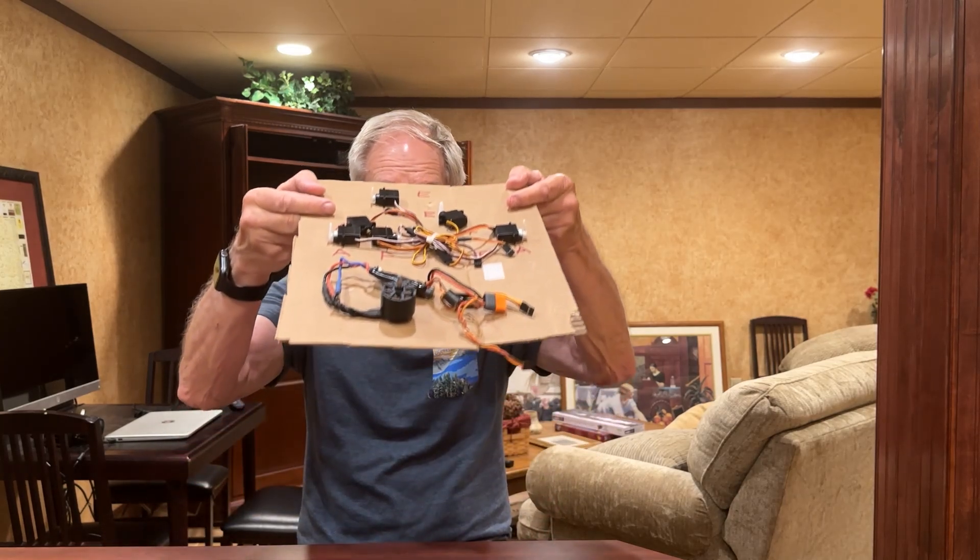It's two steps. One, we're going to reload the firmware onto this receiver. The second step is we're going to hook it up to my test board right here, power it up from the ESC that's on the test board, go into forward programming and do a factory reset on the AR637TA. That will completely unlock it — it will be in the same state as an AR637T you buy retail from the factory.